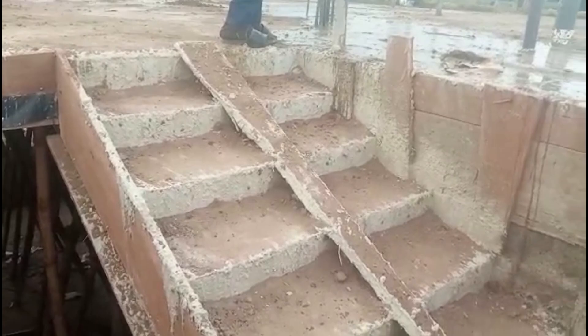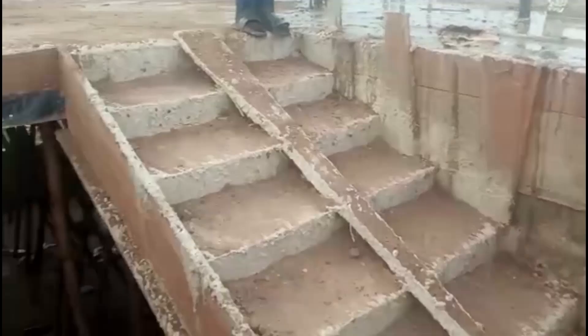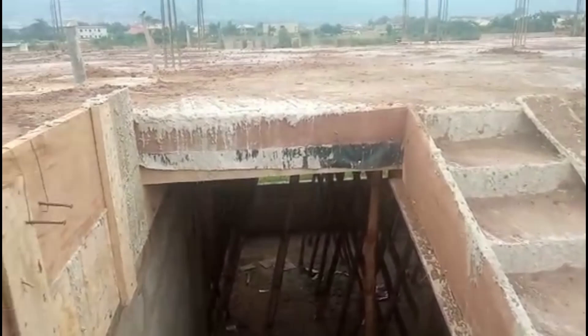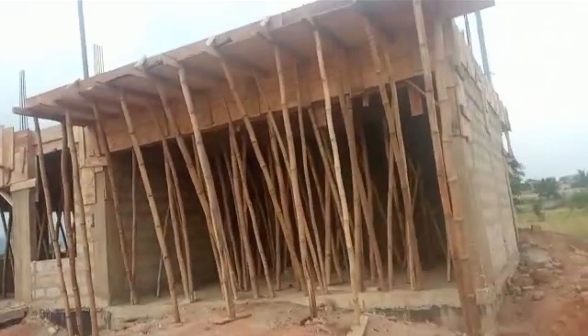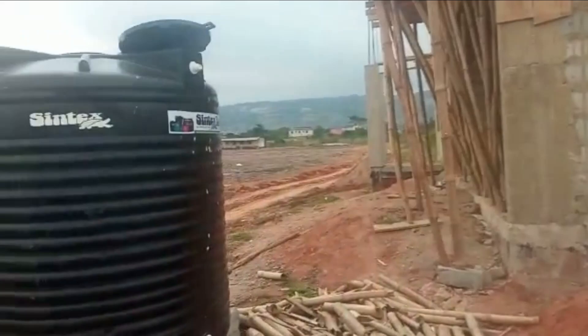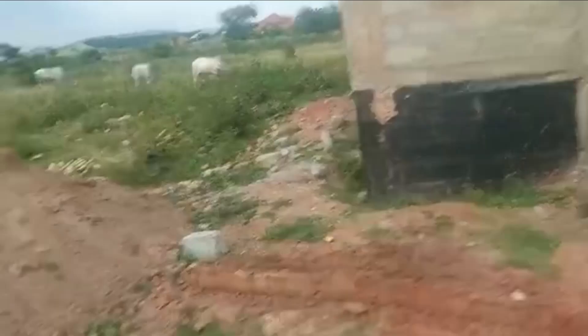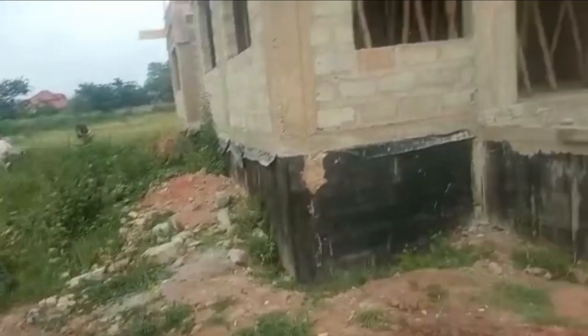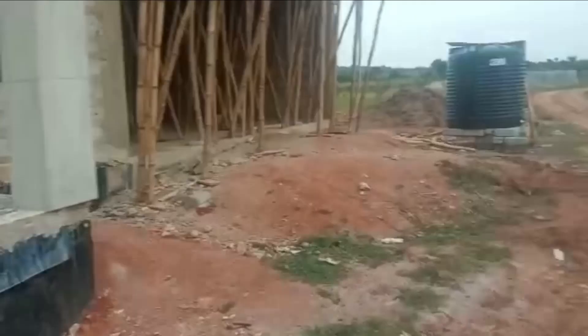Madam Rita is so excited now that the casting is done. Once you have the right people on your project you don't have to worry. I will charge you a small fee to manage your project and make sure it's done completely, nice and beautiful. You don't have to spend billions of dollars to build a four-bedroom house. Always break your project down into phases: phase one is the foundation, phase two is the superstructure up to lintel level, phase three is your decking, phase four is the first floor block work up to gable, and phase five is the roofing.